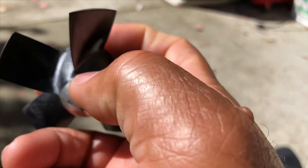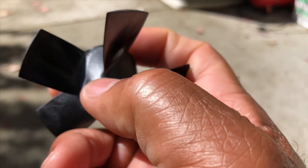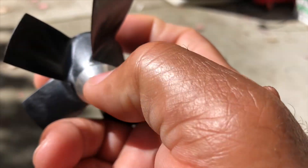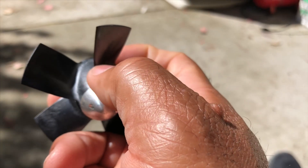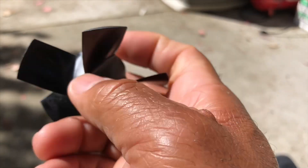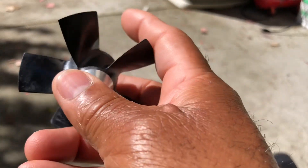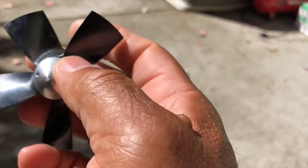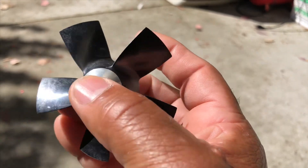I make little weights with electrical tape — cut them in squares and make them even. What you do is take that weight and put it in line with the blade, in line with that pocket. You can move it around to each one of those pockets — basically each blade. Just set it there and then run it up slowly; you don't have to run it up fast.